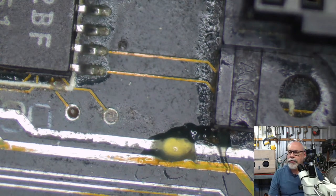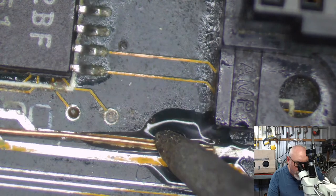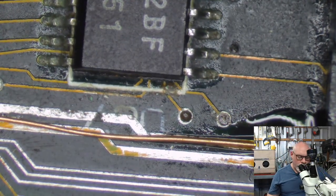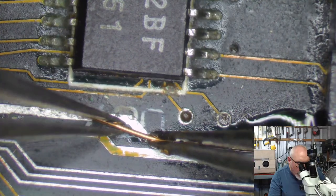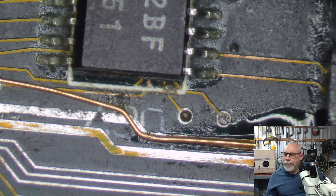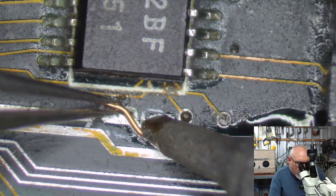Still have a prototype LC that I need you to fix. Haven't sent it yet. Yeah, so is that one of the ones that has the great big capacitor on it, yeah? Some of the early LCs, one of the capacitors up the top of the board is a huge electrolytic capacitor rather than just a little surface mount one. The later ones just have a surface mount, so... Interesting. I've never actually come across one, but I've seen lots of photos.